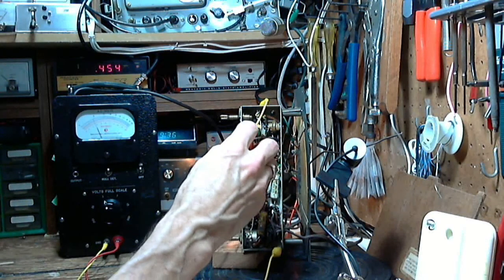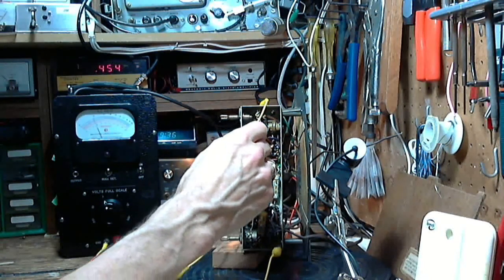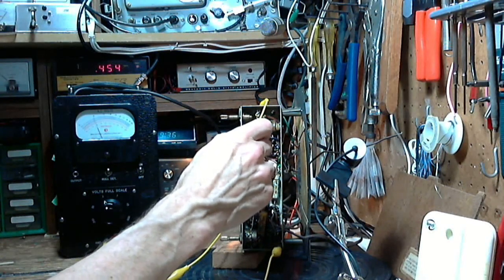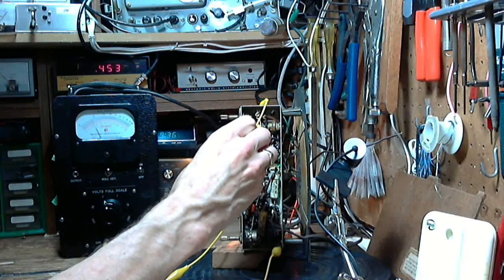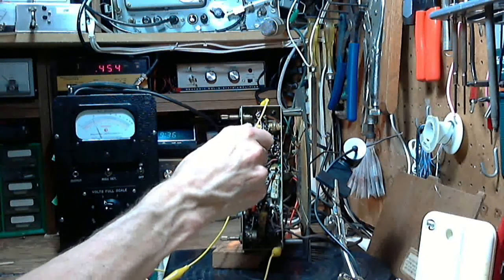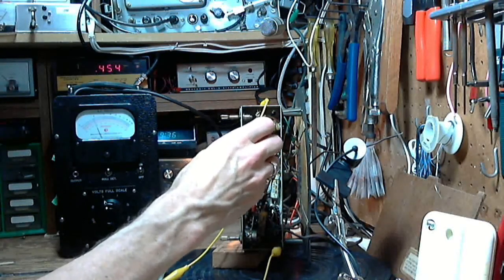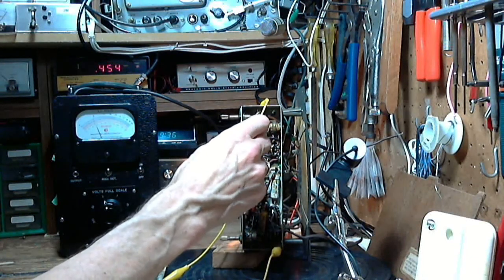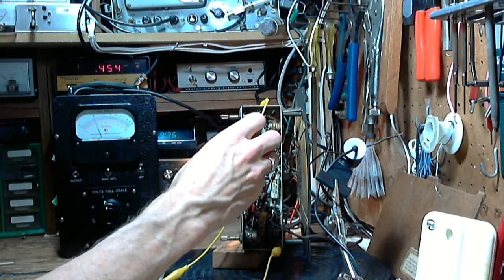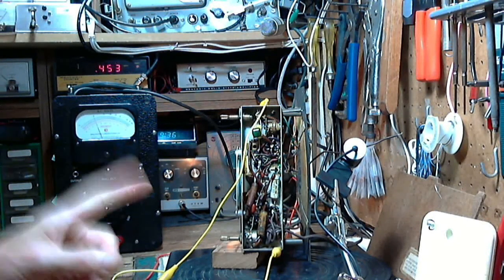Okay, so I didn't notice any change in the radio, and I'm feeling for the screw head very carefully. There's the screw head. Okay, eyes on the meter. Here we go. Down, wait a minute, can't go down in both directions. It turns out that this is tuned just fine. It was just fine where it was. And the fact is, most radios, the IF is okay. So all I've managed to do is find out that everything was good on this.